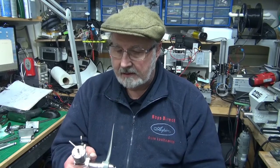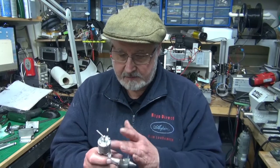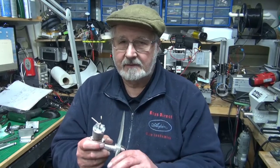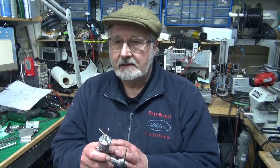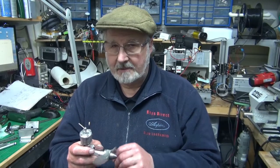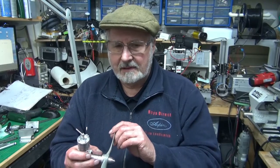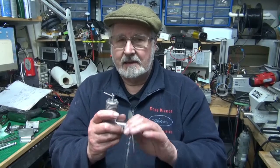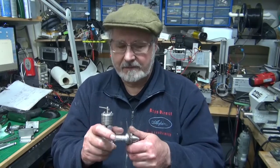So I got stuck in again and started over with the piston and cylinder. I put a reamer through the cylinder again and just took a shaving out of it. What I did this time that I hadn't done before properly was I made a mandrel to fit the cylinder, put slits in it, and used diamond paste — starting with 3000 grit, then 8000, then 24000 grit — and lapped the cylinder with this brass mandrel for quite some time.